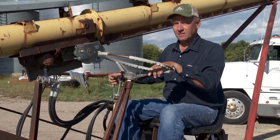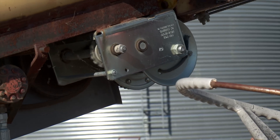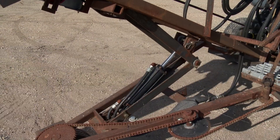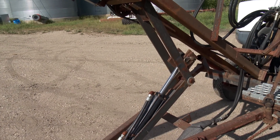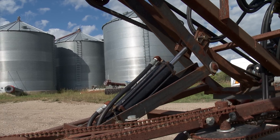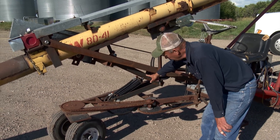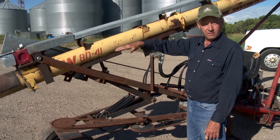The top end of the auger is raised and lowered by electric winch. He considered multiple options for raising and lowering the intake end but eventually figured out the most practical method. He tried several different positions for a hydraulic cylinder but was never able to get enough lift from a direct connection, so he went to a scissor lift — sort of like a truck hoist in miniature — which gives him enough range to raise the auger high enough.